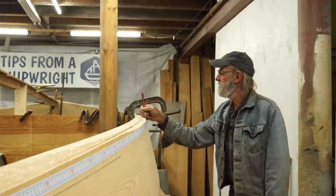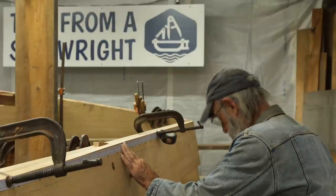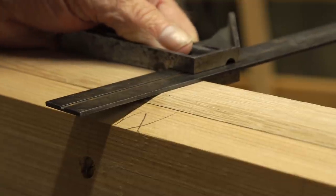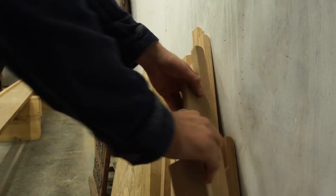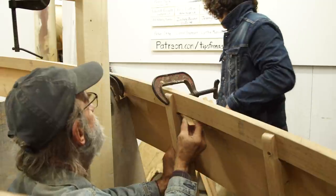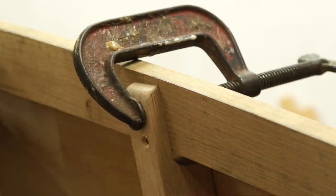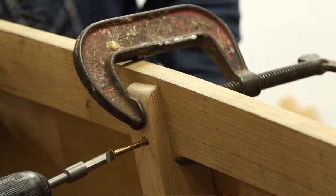Now that we've got all our frames out, the next thing to do is hang them. We're going to take a metric tape and divide the length of the chine log up into equal sections so that the frames will be all equally distant apart at the chine logs. We're using a metric tape because it's so much easier to divide a length on a metric system than it would be in feet and inches. I've divided it around the very outside of the boat because that's the only way I can keep the tape measure in position - it won't work on the inside. So then I just have to square the marks over from the outside to the very inside of the chine log where I'm going to hang the frames. Then Caleb and I are going to hang the frames on those marks, but we're only going to put one screw on the very end of the frame against the chine log, so the frame is still mobile and I can plumb them later on.